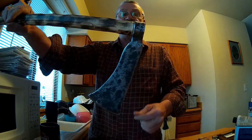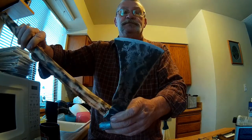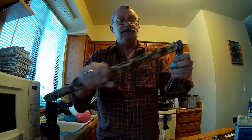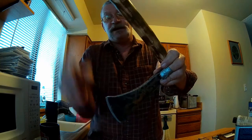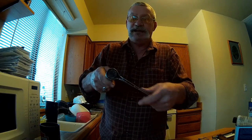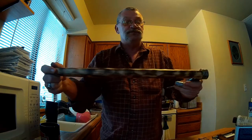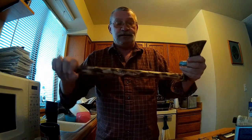I also made this hatchet — it's a Native American war hatchet. It looks rough because it's supposed to look like one from the mid to late 1800s. I'm making it for a friend who is part Native American and loves everything Native American. It was a piece of leaf spring I forged into a hatchet head, then I made a loop out of 5160 leaf spring, folded it over a round pipe, and forge-welded that onto the axe head — two separate forgings welded together. The handle is a piece of poplar round stock that I burned and finished with paste wax.